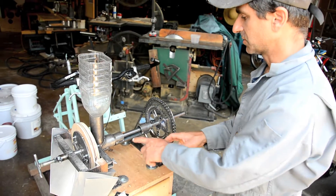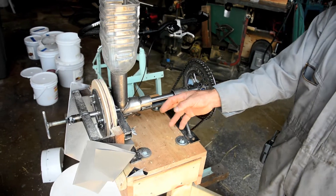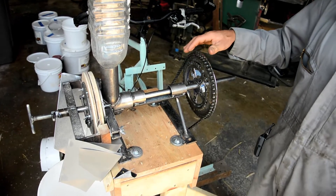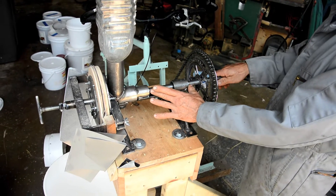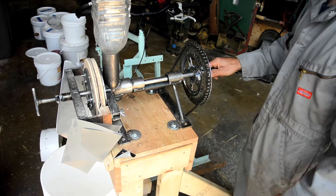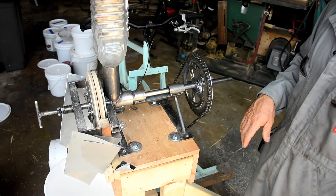This mill has two sealed ball bearings — cartridge bearings off a go-kart, so they're very inexpensive sealed bearings. The two bearings are separated by a wide distance so they can account for the torque imparted by the bicycle drive under low-speed, high-torque use.